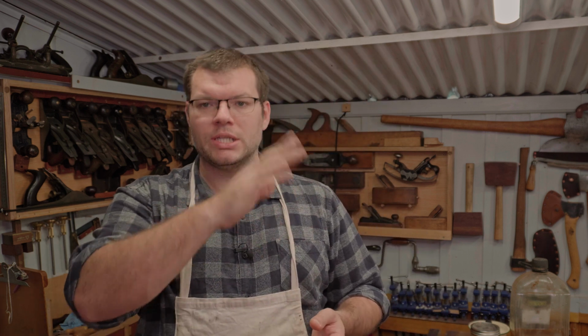You've got to work fairly quick with subsequent coats, and you want to try and get a coat across in as few strokes as possible, because it's breaking it down. Your bristles, if you're using a brush to apply it, can leave streaks in it, and it'll go deep into the surface. So you want to get second, third, fourth coats on as quick as possible.